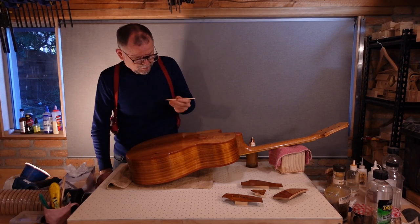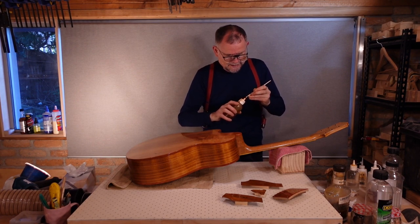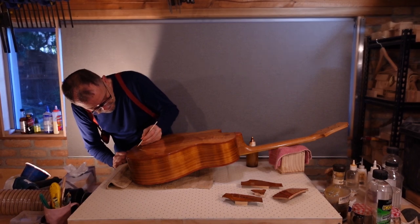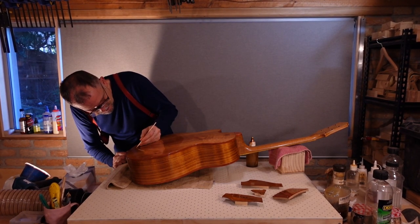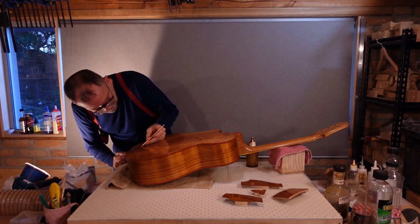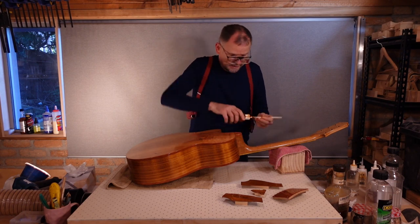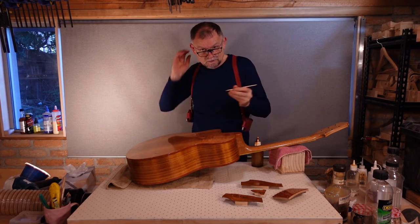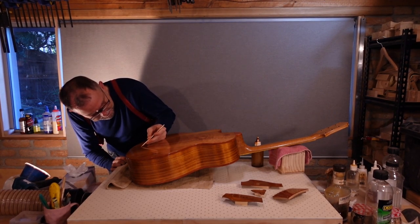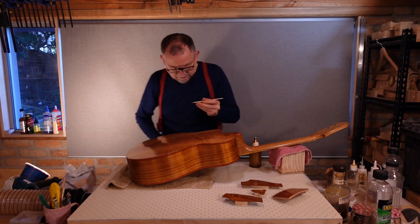Change of plan, and this could be very, very dangerous. There were one or two places where just a tiny little splinter had lifted off the edge of that crack. Using a sharpened kebab stick, I'm putting minuscule lines of shellac along that area. This could go very wrong — it's the sort of thing that has gone wrong in the past. Because a drop of shellac doesn't just sit there; it kind of lifts off the shellac in the surrounding area due to surface tension or something, and you can get uneven colouring. I'll let that harden, and then we'll sand it and continue polishing.